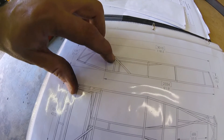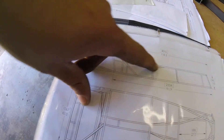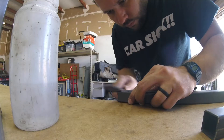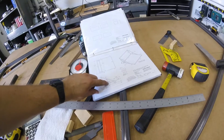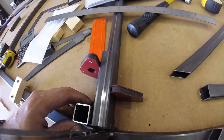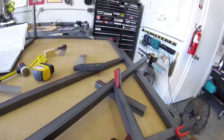I think what I'm going to do is tack this one in, tack the back piece in, and get that triangle set — then I can knock this guy out. Cut, file, repeat. In my little jig — looks a little crazy but it works. From the measurements I have, there's no measurement up here, I only measure from this bar: from here to here, and then from here to here, and it lines up. So I'm going to tack it right there, and maybe right there, then flip it and do the same. Make sure everything's still hunky dory. It looks pretty straight — tack this guy, tack that guy.